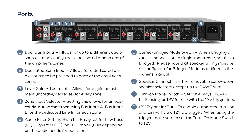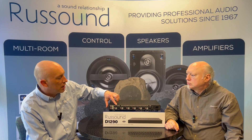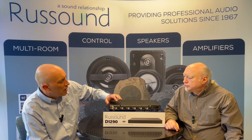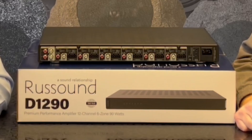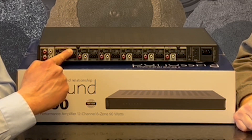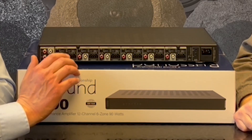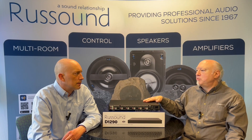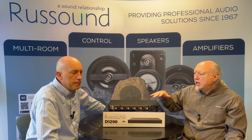Let's take a look at the back panel and see how you would set some of these features. Right out of the gate, it's 90 watts per channel out of a single zone at four ohms, and 45 watts per channel out of a single zone at eight ohms. You've got six zones, 12 channels, so you can drive a lot of speakers with this. There are switches on the back for your high-pass and low-pass settings, or you can just use full range. If you want that high-pass, low-pass feature, it's built in. People have asked us if we made a subwoofer amp — essentially now we do, and it's even better because it's like a Swiss Army knife where you can have multiple applications depending on how you set that crossover.